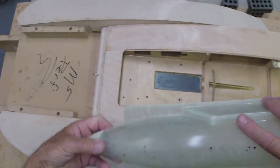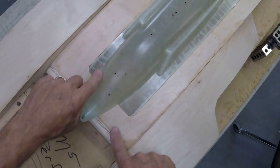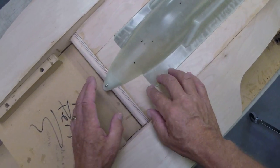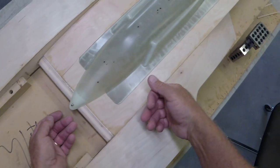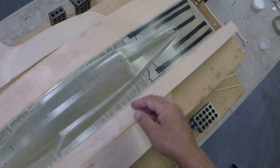And that does a couple things for me. One, when I slap this down, I'll just push that really quick and that holds on. That'll keep water from getting in there easily. Again, it can get in there from here, that's going to be behind the carburetor and hopefully avoid trouble. So that keeps water from getting in there easily and it keeps the cowl from sliding forward. So I'm not creating any fancy means by which to hold this in place on this boat.